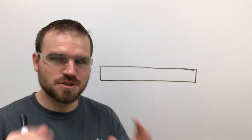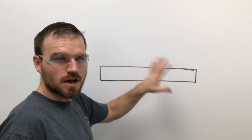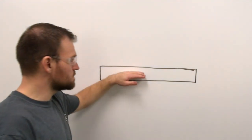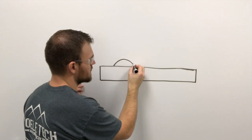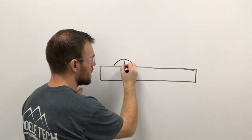In this demonstration video, I'd like to show you how to weld 50% overlaps. First, I'm going to show you up here on the board how things are going to lay out, talk a little bit about theory, and then get out there and show you how to do it. We have our base metal here and we're going to start with a stringer bead — that will be bead number one.